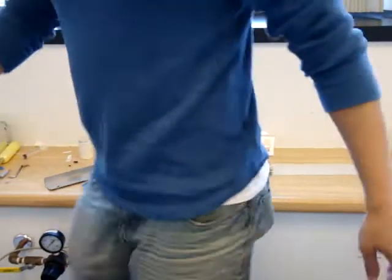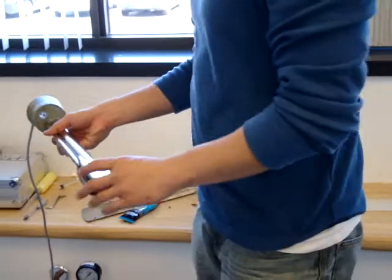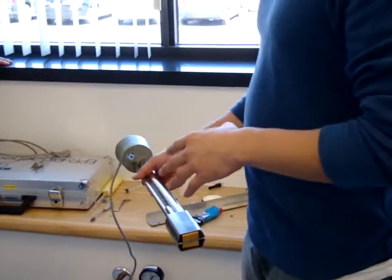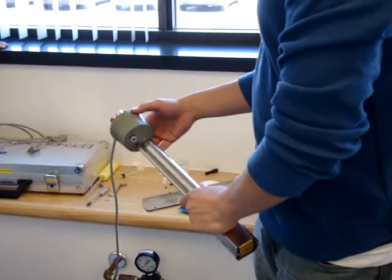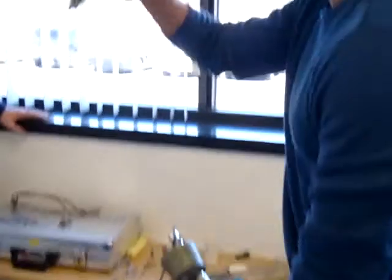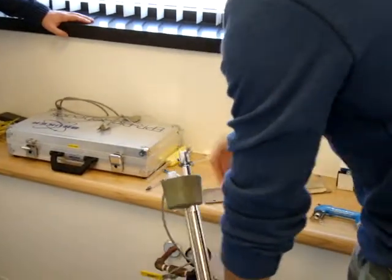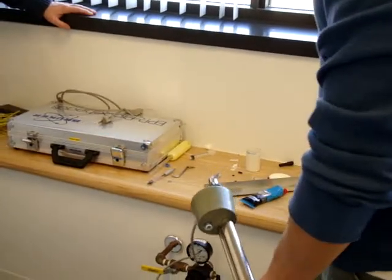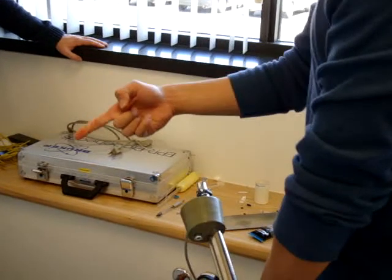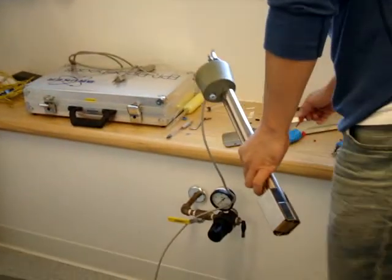So now we insert the evaporator into. What do you call it again? Sorry? Evaporator. Okay. Right, this is called the evaporator. Structurally, as I said before, it's got a heater here, which heats up and pushes liquid nitrogen through. And this is where this thing will go in. It basically acts like an in-between sort of unit. A bridge? Right, a bridge. And it goes here, and this is the venting hole right here. So the first time you put it in, you want to keep this open to relieve the pressure. Also you don't want to put it into the tank too fast, otherwise this will clog up and you're not going to have any flow through. So alright, let's put this guy in.